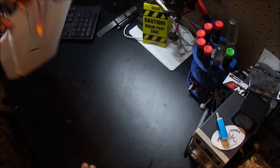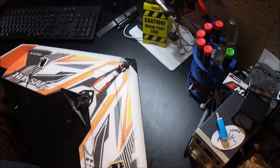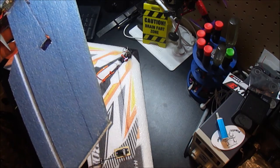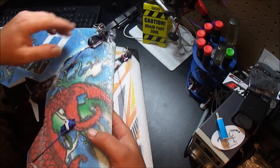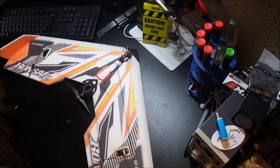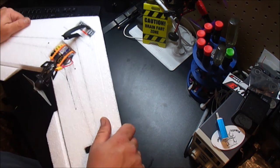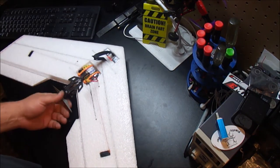A lot of guys want to use old quad parts for wing builds. I used an old Afro ESC which had a two-amp BEC in it and it works fine — I can fly about four minutes with no overheating. I did an amp test with everything running — servos, camera, speed controller, receiver — and you pull about 0.2 amps, so you've got a lot of headroom with a two-amp BEC. External BECs are better because if your ESC fails you still have your five volts and can still fly. With an internal one, if the ESC fails you lose all control.